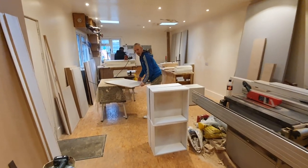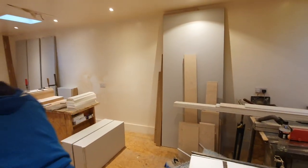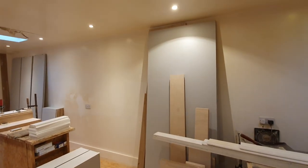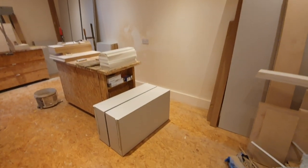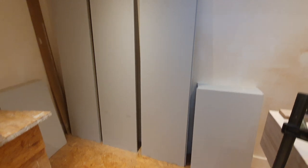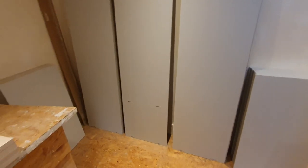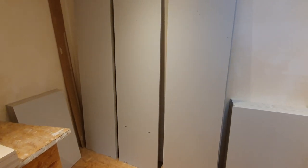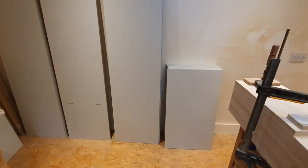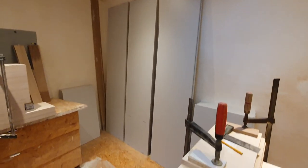It's the last push - we've got one more to fit before Christmas. We've fitted three, and we've got this laminate one, the gray at the back. We don't do much laminate. There's a set of drawers for it, all the sides. We're waiting on adjustable shelf peg sleeves because as we're drilling out, it's chipping the laminate on the peg holes. So we're going for sleeves - we drill the holes and knock the sleeves in for the pegs to sit in, but we're waiting for them to know the drill bit size.